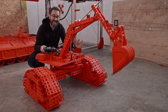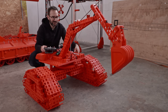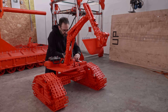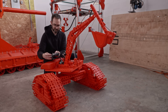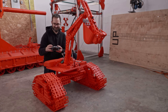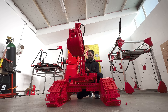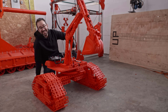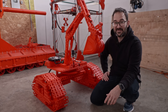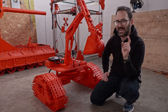I've added a couple of mechanical end stops on the base because I didn't want to deal with the rotating wires. And just like that it explodes because I didn't trim the servos before switching it on. The good thing is that just a couple of screws explode and I can just swap them and reset, but I need to trim my channels first.